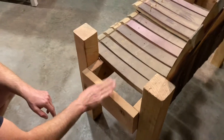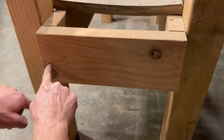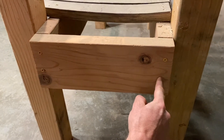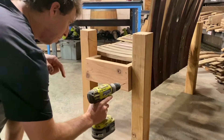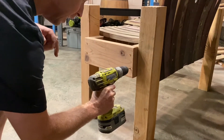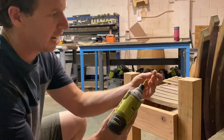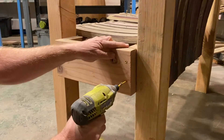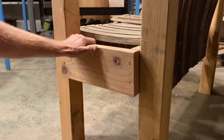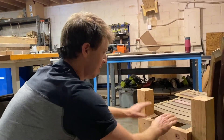We're now going to connect this side piece. There's one, two, three screws, and there should be a fourth — I'm going to drill that right now. Attaching the side base piece to my legs, I'm going to countersink right in here, and then take my three inch deck screw and go right in. That's on tight. So now I have the base piece built — I'll do the other side too. There's one screw, two, three, and then four, using a three inch screw right in that hole.